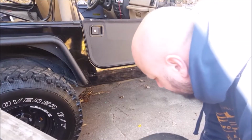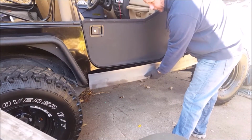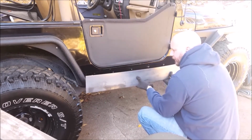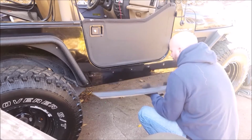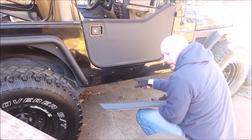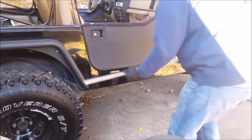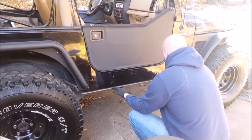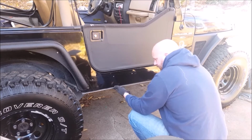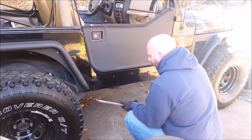So the first thing I bought was some 6-inch plate. Go right here. I'll have to cut corners into an angle, so I'll have to cut 2 angles, one on each side. So that's what will go on the side right here, down to about 3/16 of an inch below right here. I then bought some 2-inch 3/16 that will go under here and weld to the edge of that 6-inch, and then I'll bolt it into the side where these holes already are to hold it up there.